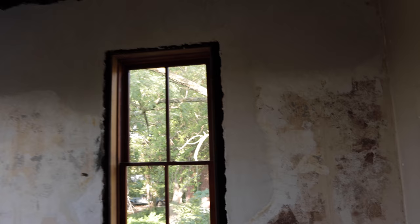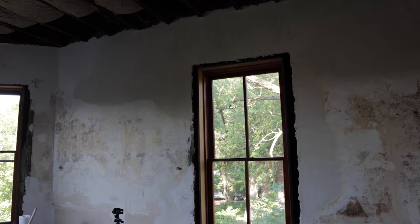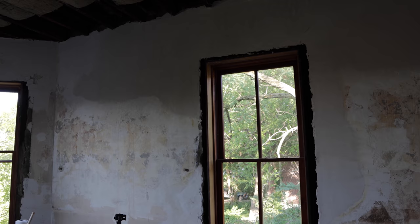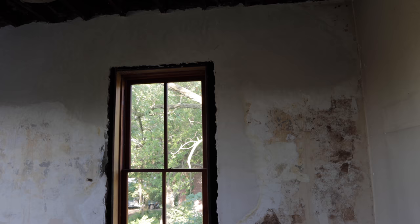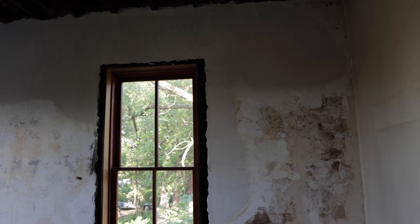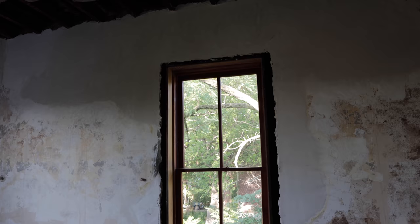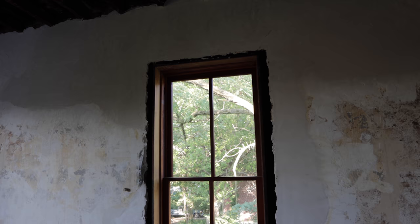I've also somewhat cracked the code on the plaster up here, guys, as far as getting it to stay without cracking like crazy. Essentially, it's just lots and lots of water and really watching it. I tend to like to mix this stuff somewhat thick, because obviously it sticks better, but I've learned that I need to make it extremely runny with water, and that seems to do the trick. It still makes it a lot less easily workable, but it hasn't been cracking as bad, so that might be the trick. So when you're in hot weather, mix quite a bit more water into it. Make it less like pudding and more like milk.